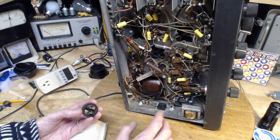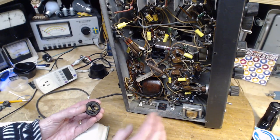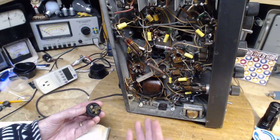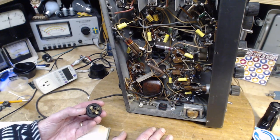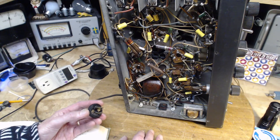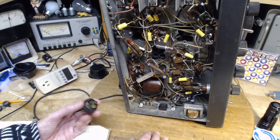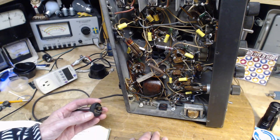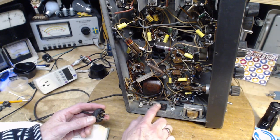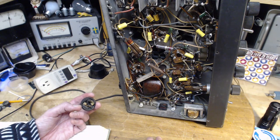So the ticks would be drowned out - but again, it depends which way you've plugged it in. In one case the neutral line is here, and conceivably there isn't much noise on the neutral side. Most of the noise is on the hot line. Most things plugged into outlets - high power devices - would already be shorting out those RF noises anyway. My conclusion is that this is a noise suppressor and nothing more. If you cut it out, you'd hear ignition noise from the 1940s - which modern cars no longer produce since ignition is well-suppressed.